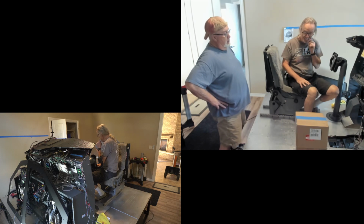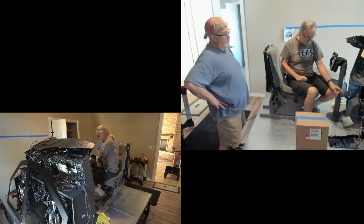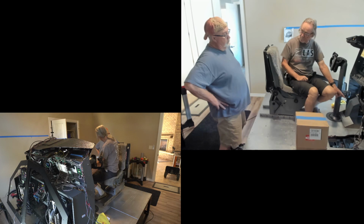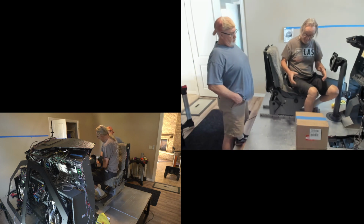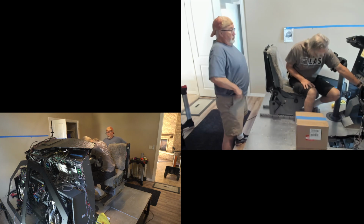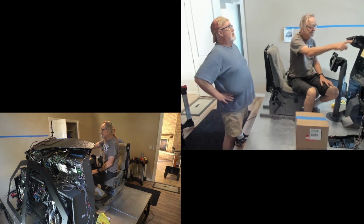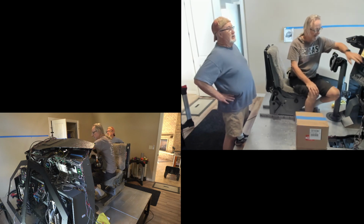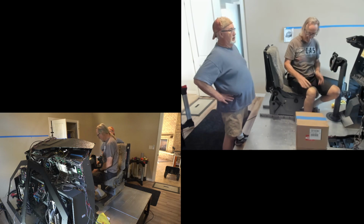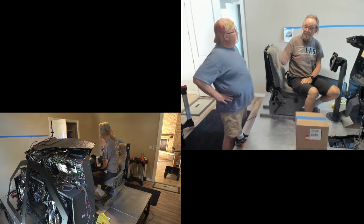So the radios hook into the LAN card, and that hooks to a network cable. And it goes down to the 2.5 gig switch. Both CDUs go to the switch. The I/O boards, the one back here and the one in the pedestal, have network. So these are USBs, and all the connections right here. It's all set to go. Power and USB, right there. Hook them up: CDUs, throttle quadrant, pedestal, the other seat, and then the overhead. We're flying.